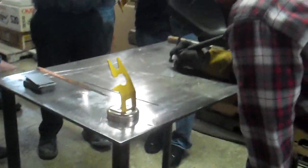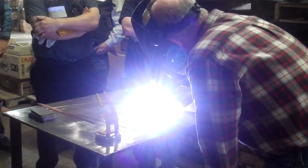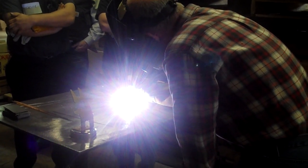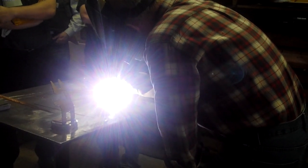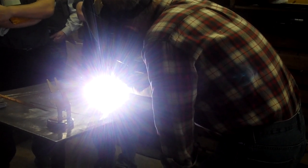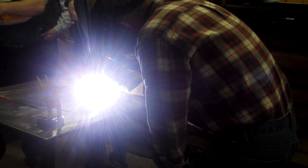The nice thing about TIG welding is you have 100% control of the power source. I'm going to strike an arc — right now you can see I haven't even melted the base metal. I can move this around to where I want to go. I'm going to start right here, hold it about an eighth inch off, and slowly increase the amperage. You can see the molten puddle there. And for you guys just starting out, once you get that, you just want to work that puddle along and keep constant motion.